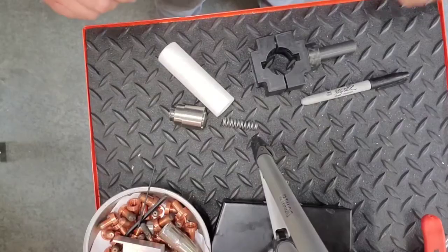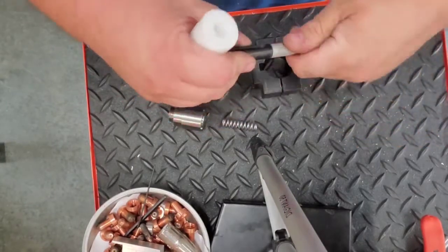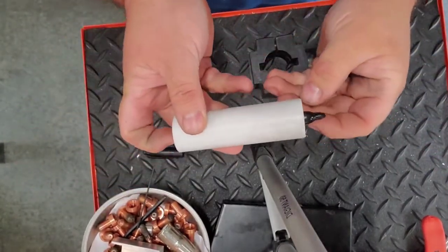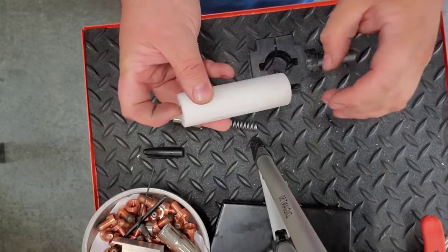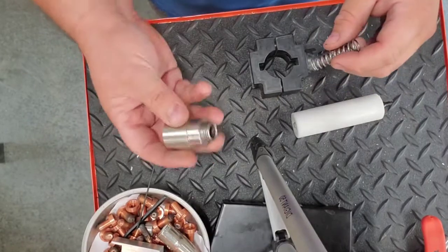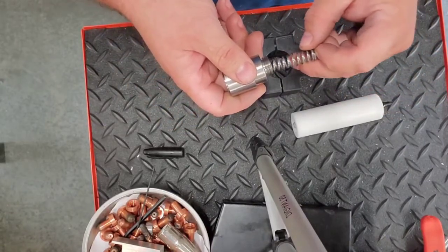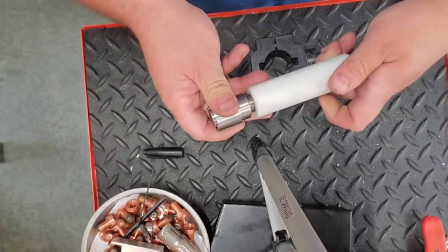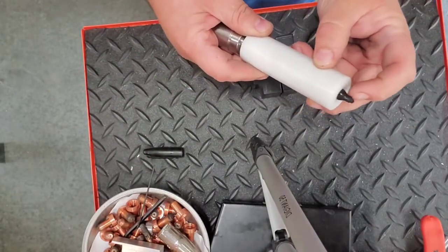Here are my parts. This is the part that I machined — a Delrin piece — made some steps in it and clearance holes. How this is gonna assemble: I'm gonna take a pin and drop it through the hole. This will move in and out as there's fluctuation or as it touches off on the sheet, because it has to come down, touch the sheet, and then back off. I had a spring from a scrap piece I made for a customer, so I'm gonna utilize that — load the spring in the back — and then thread this Delrin piece into position.